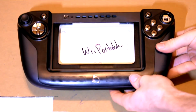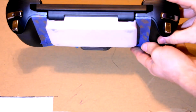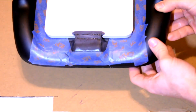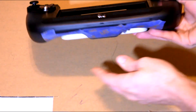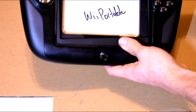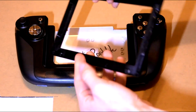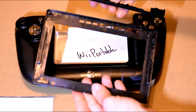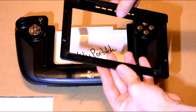Alright, so I've already shown you what the Wiikipad Switch is. Now I'm going to highlight the steps and show you how I was able to build it. In this video, I will be going over the Frankencasing process. That's where you take a few different plastic enclosures and combine them together with different specialized glues and epoxies, and then you add filler and sand smooth to make it look seamless. Then from there, I'm able to place the electronics inside and wire everything up.